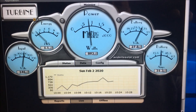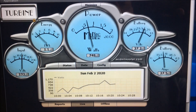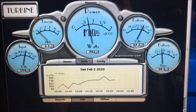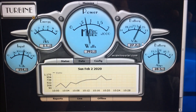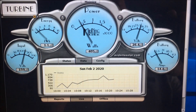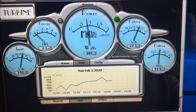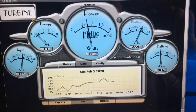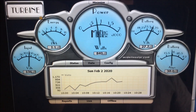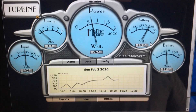This is just the wind side of it — the sunshine is out so we're receiving good sun and good power. Here we've got our 1000-watt wind turbine and we're exercising it quite well in this bit of wind today. Riding the wind curve is the most challenging part. There's the green light — everything went down because it told the clipper to slow down the turbine. It's on again and we're at 150 volts. It's coming and going as far as the AUX2 output controlling the clipper, so it's doing its thing. I've got the graph up.